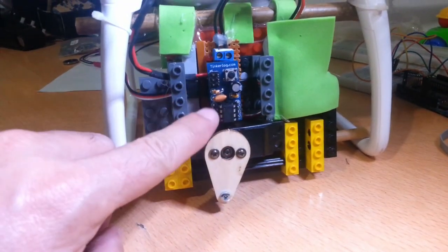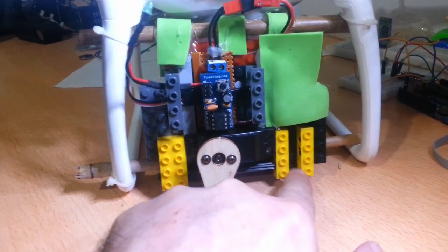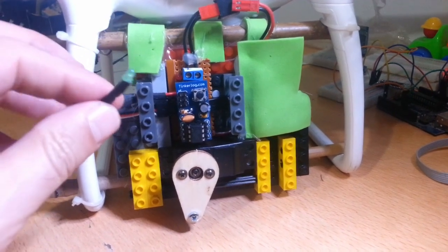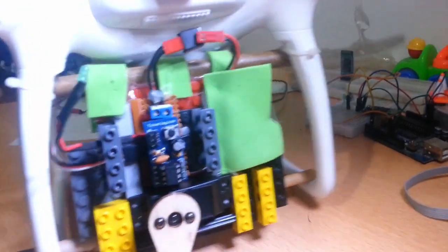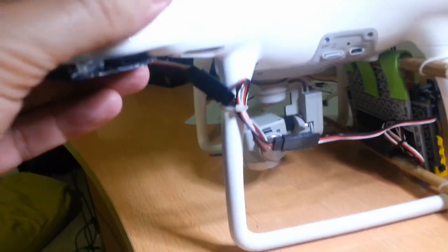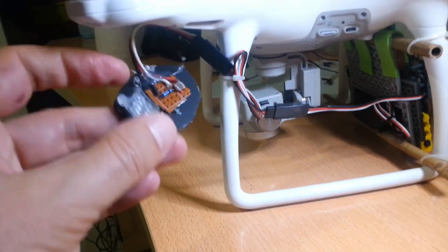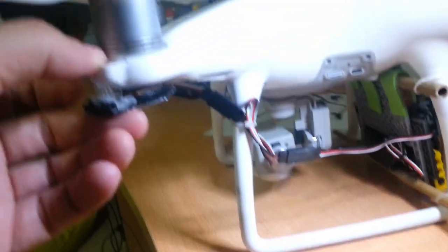You can see here an AT-Tiny that runs everything, a servo that moves a Lego hinge that closes here, and we got here a battery behind this — a 3.7V battery that we scrapped out of one of these other quads. There's an LED that's switched on when it's turned on. I'm now rotating it; you can see the back of it, and this is the light sensor. This is how you switch it on and off — by turning on and off the front red LED. It's a simple LDR with a 10K resistor inside, and it just comes under here.